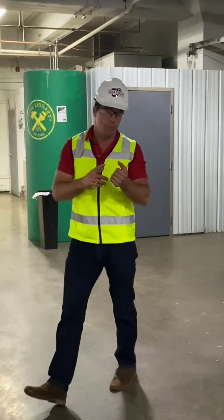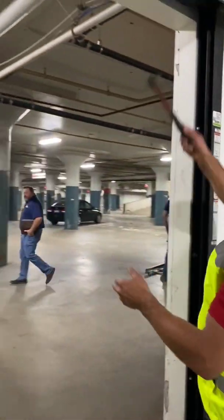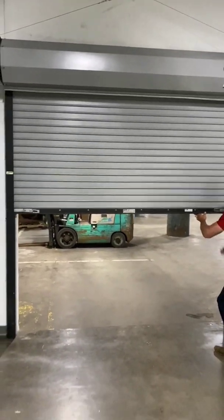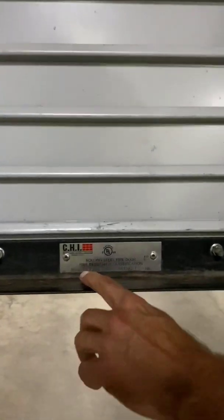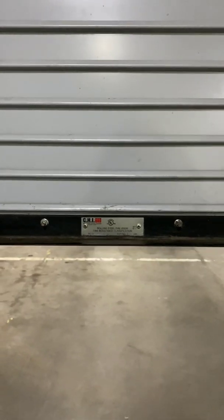Moving back to this side of the opening, the next thing I need to do is finish my visual inspection. This particular door does not have a chain hoist — this is a reach-and-grab, and we've got a fusible link here. This is not the drop test yet; I'll just go through my visual. One absolutely critical thing is to make sure we've got this identified as a fire door — this is the actual UL label. It's going to tell you your hour rating, and it provides the manufacturer and all the critical information needed to service this door properly. I'm going to operate this door to make sure it balances, which it does. It rests nicely on the floor.